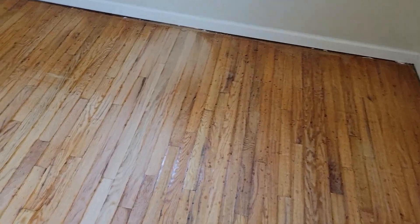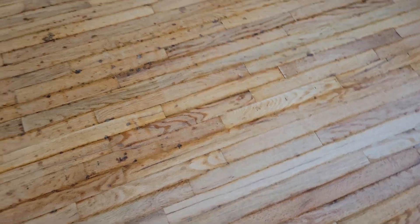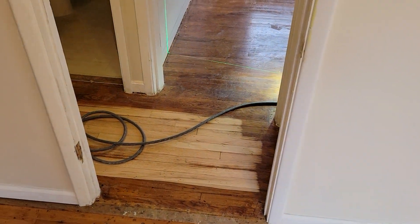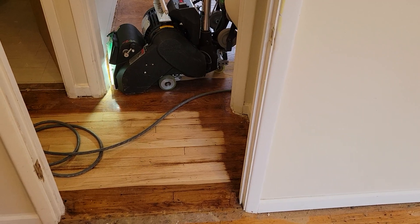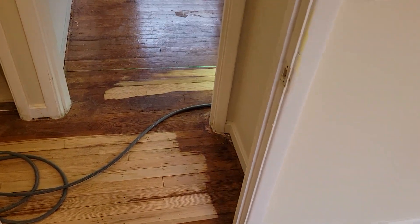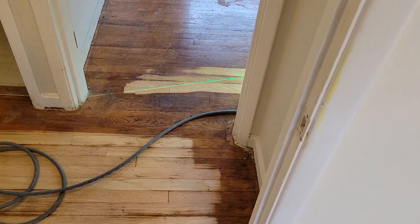Day one sanding and refinishing — we're on 36 grit right now. Got the new machine in action; it's a new American Sander Legacy. It's what's considered an 8-inch belt sander, set on a low setting — low pressure — so it's cutting pretty good.